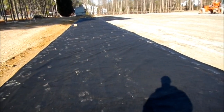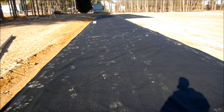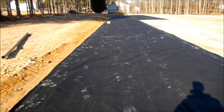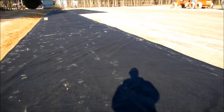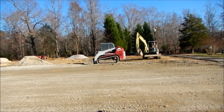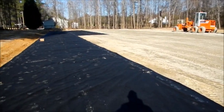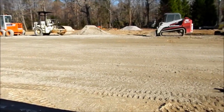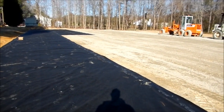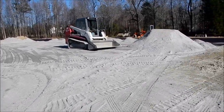What's an acre — 44,000 square foot? So a little over half an acre we've got to completely cover, and put four inches of compacted screenings on top of that and then two inches loose. We're also going to surround it in railroad ties. It's coming along pretty good. Bring another roll of fabric over here and keep on rolling this out, getting it covered before it rains again.